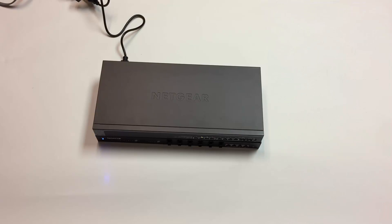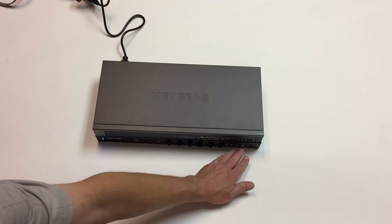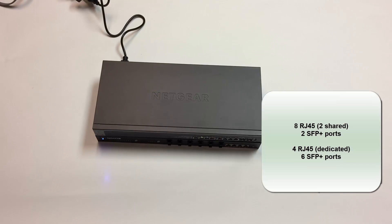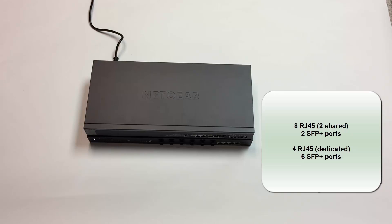I'm actually using this for a Xeon D cluster, perhaps a vSAN demo at VMworld, and I hop on a plane in only three days. Very short time for me to get to know the switch. But really, there's not a whole lot to a managed switch other than setting up an NTP time source if you want the clock for the log files to be right. I'm basically just plugging in three RJ45s to three different servers, and a fourth server gets an SFP connection. A smaller and more affordable switch would be desirable for a home lab. Thanks for watching and for visiting Tinkertry.com.